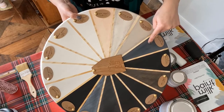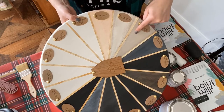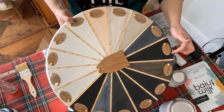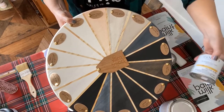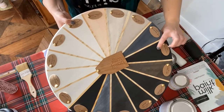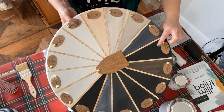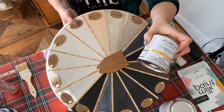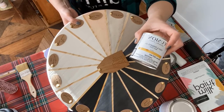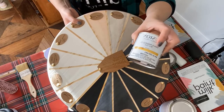These are oil-based colors, and I said you shouldn't use oil-based over white — but obviously I am using it over white here, just with a very different impact. Our natural stain and finishing oil in the Fusion line is a good option over our black milk paint. I would not use the natural stain and finishing oil over white because in this situation it's going to get very ambered and yellowed over time, so we want to stay away from that.